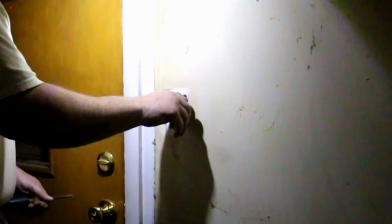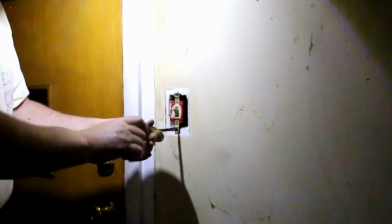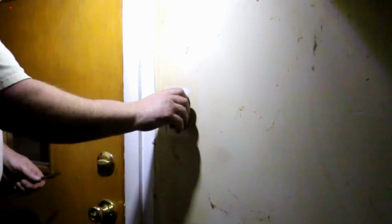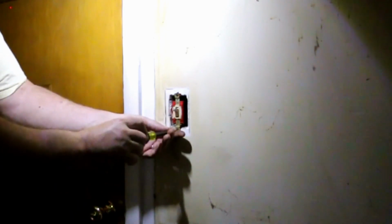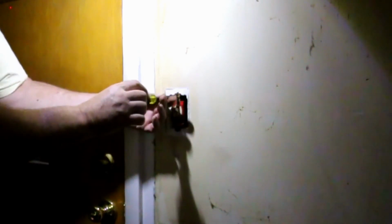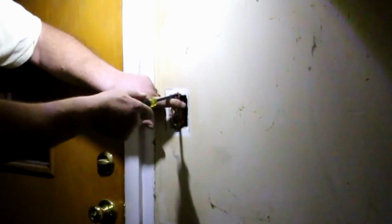When they wired the house, well, when they put the plasterboard on, they put the plasterboard on and then they put a skim coat of plaster itself over the top of the plasterboard. So it doesn't have lath per se. It has wallboard, plasterboard, acting as lath and holding the plaster as a base coat. Not a bad thing to do, but it sure does make it difficult to do any repairs.